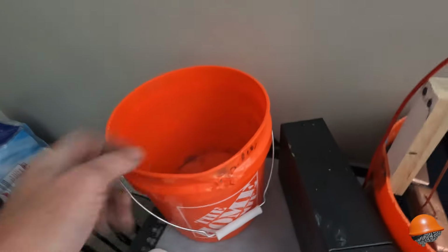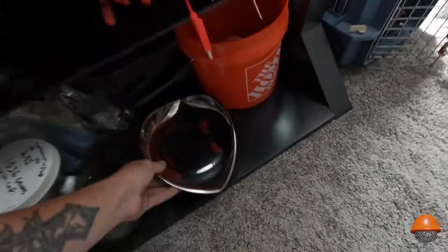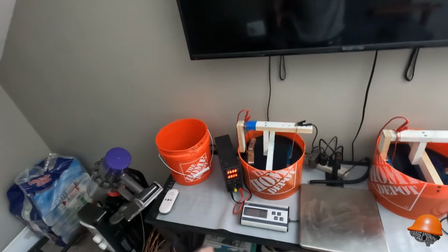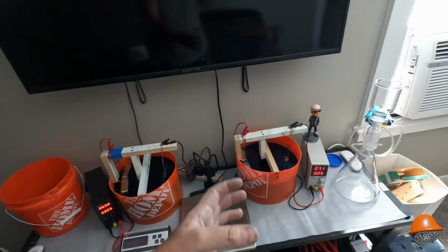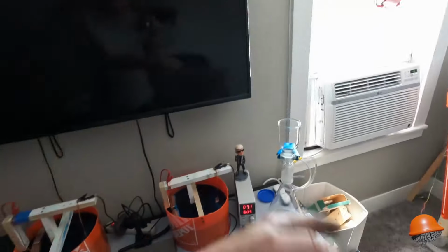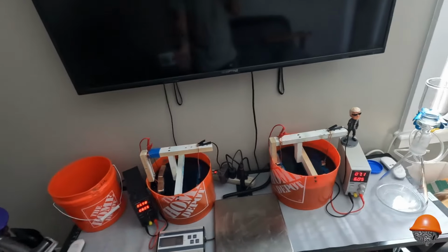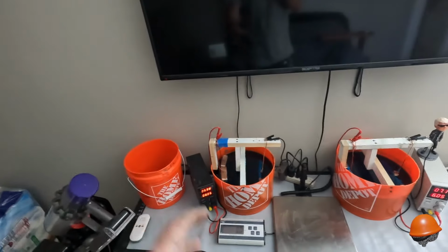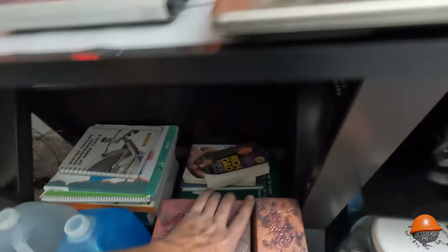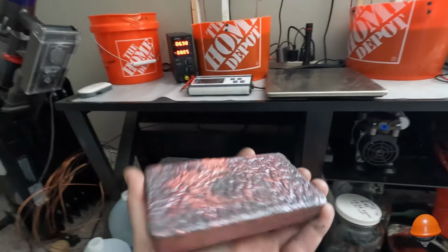Unfortunately, we melted the bucket a little bit until I figured out this metal dish trick. That's a temporary solution. I gotta find something better. I need to find a big metal funnel that has a wide opening that I can set right on the opening of the forge. Because the problem is, I have to pull the crucible out. It starts cooling off. The forge starts cooling off. By the time you get it reloaded, put back in the forge, it takes even more gas to get it back to hot and get it melted right to the center. So the less times you gotta open that lid, the better. That's why with this stuff, the scrap, I just feed it in through the top.